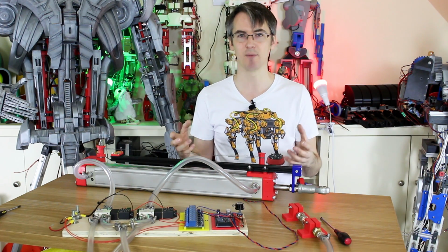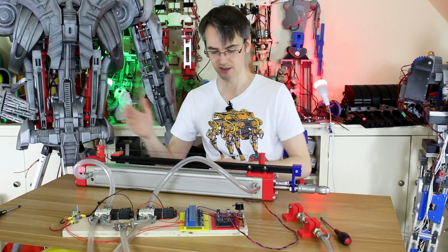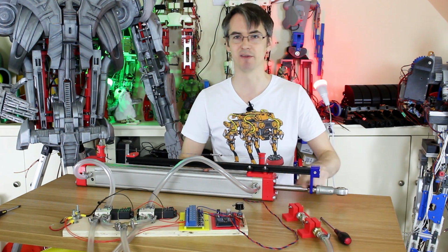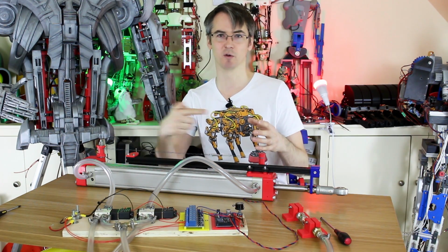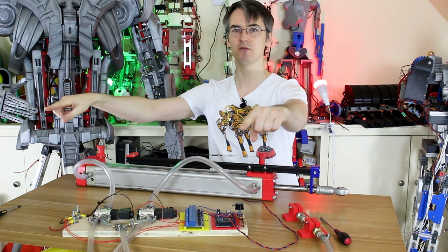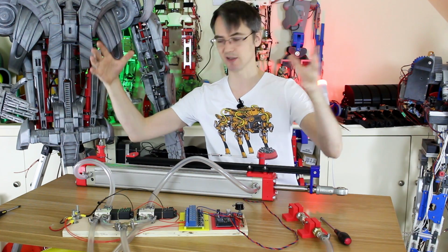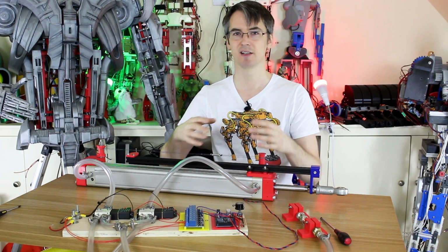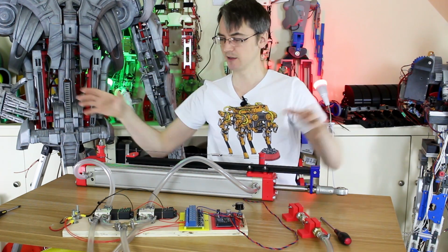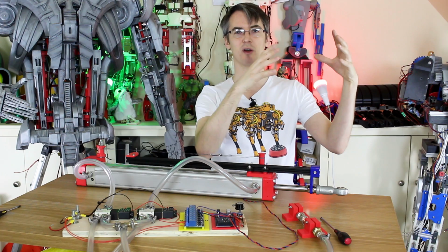So the only answer I can come up with is that when we lock air in the cylinder, we've got one higher volume side and one lower volume side due to the rod that's part of the cylinder, and so that's quite a big difference, which is pushing the cylinder, of course, in that direction. But when we tail off 2 24-litre air tanks, obviously the difference is the 24 litres plus the volume here, or the 24 litres plus the slightly smaller volume here. So compared to that whole massive volume, the difference is actually quite negligible between the 2 volumes. So we've got 24 litres plus a bit and 24 litres plus a very slightly smaller bit, so that's hardly any difference.